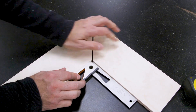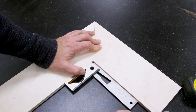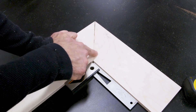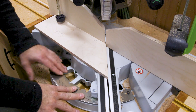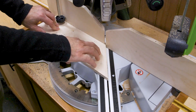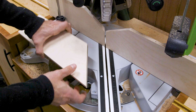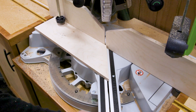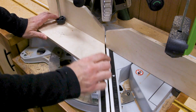We've got to figure out what part of the miter needs to be trimmed to correct this error. In order to get this piece to sit square, I rotate it slightly and that closes the gap, but it opens up a gap at the outside corner — so we need to remove material from that part of the cut. I can come out of the 45 detent, tap it a little bit, lock it in, then recut both pieces.